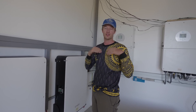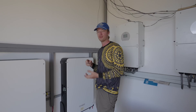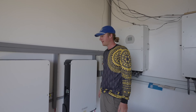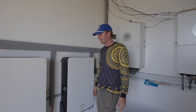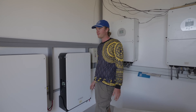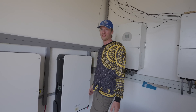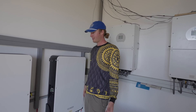The lowest battery percentage when we wake up before sunrise has been 47%, and that's running with two air conditioners, a fridge, and a water dispenser — hot and cold water all day — which was really pushing it to the limit for nighttime. In the future I will add two more batteries to bring it to 50 kilowatt hours, unless we get a wind turbine to generate some electricity at nighttime. But 30 kilowatt hours is plenty enough for us so far.